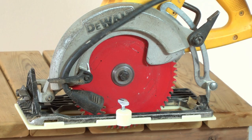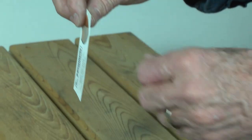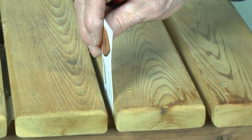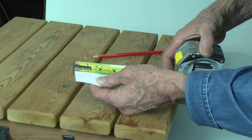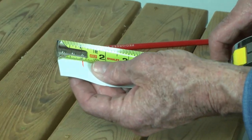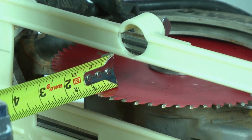You need to measure and set the saw blade to the required depth. Using a card or a piece of paper as a depth gauge, place it on top of the floor joists in between the decking and make a mark on the side. Measure the length from the paper and subtract a 16th of an inch, and set the saw depth to that measurement.